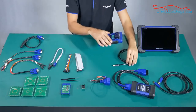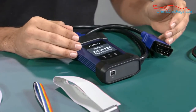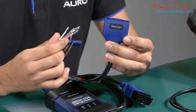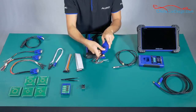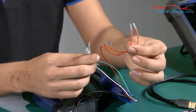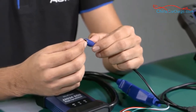I'm going to take the auto flash. As you remember, this one is used to make communication with the car by the OBD. In this case we are going to use another accessory which is the AAC001, used to connect the IM600 to the module through the DLC cable of the auto flash. We connect it like this. The remaining cables are used to connect the ECU directly — we need to remove the ECU and put it on these cables. These cables supply the battery voltage of 12 volts to power the ECU.